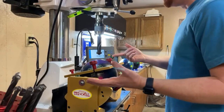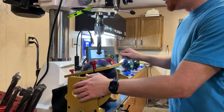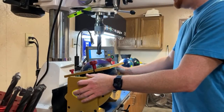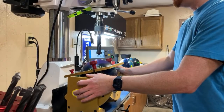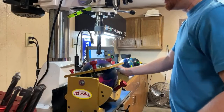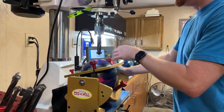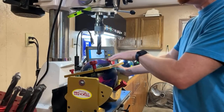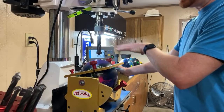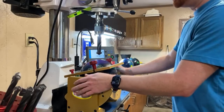Now, since this is a known constant, since I know exactly what it was set at, we've got the pitches right. But the thing that we want to do when we're drilling the slug out is to move faster. What this does is, because this is a very, very small tolerance, it's very, very difficult to get it perfectly back in exactly the same spot so that you're not a little bit to one way or the other.